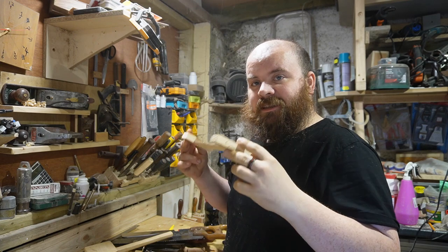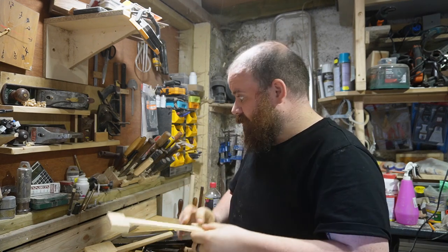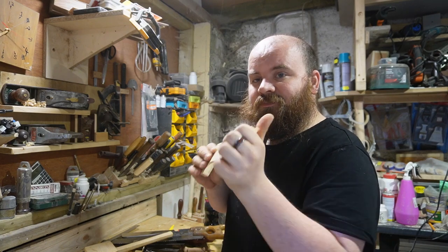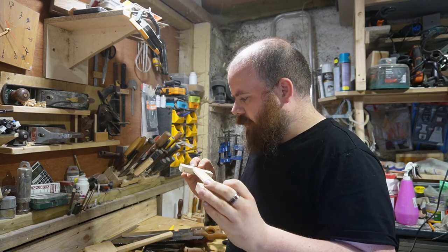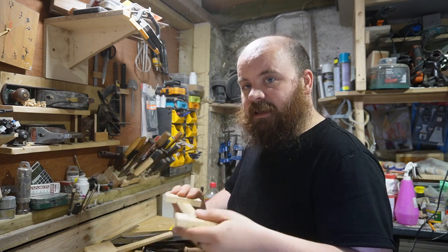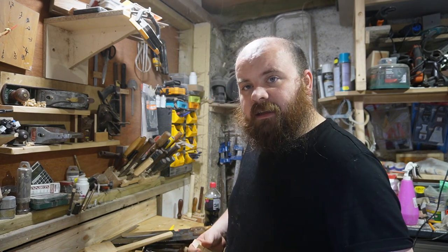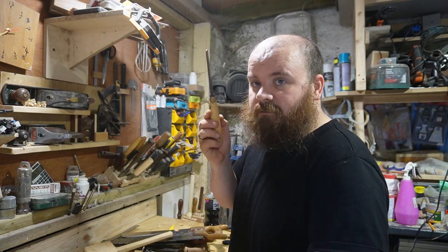So that was completely unnecessary. It was kind of cool. So the dovetail here is a blind dovetail, which means it doesn't come through, but it just gives those a nice little join together. So I'm just going to clean these up, give them a little chamfer, sand, and we'll glue this in, and then that's ready for the toolbox. Then I think we'll work on getting some sharp stuff in there. Chisels.